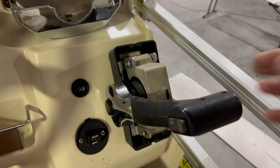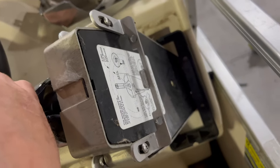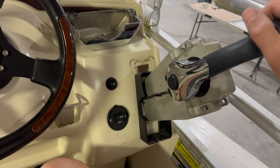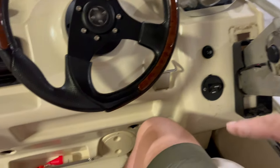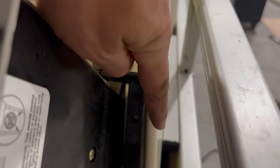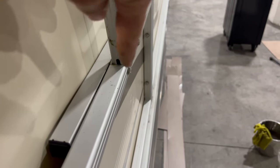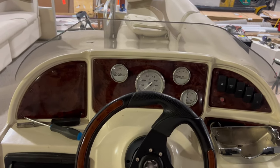Now that I've freed all of the wires, this can pull out far enough for me to get at the back of the control box. We've got videos on really similar control boxes to this and how to uninstall them, so take a peek at those. I'm going to get this pulled out of here and then unbolt the console from the floor. This bar here spaces the console out, and it's actually bolted through the console — that's going to make it line right back up perfectly with the railings and furniture, making the boat come back together a lot simpler and easier.